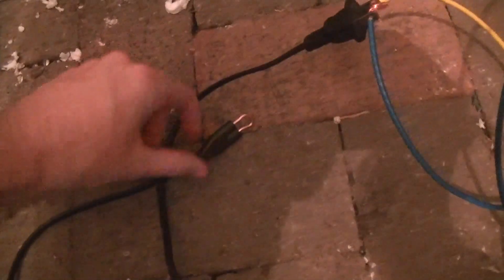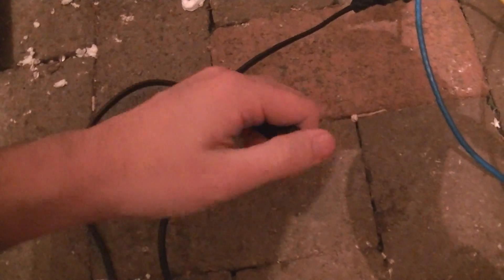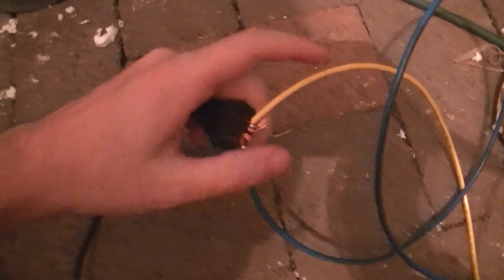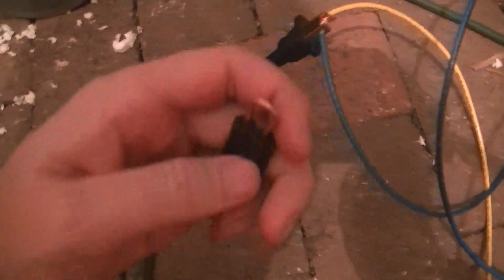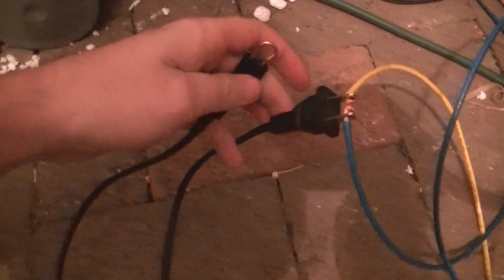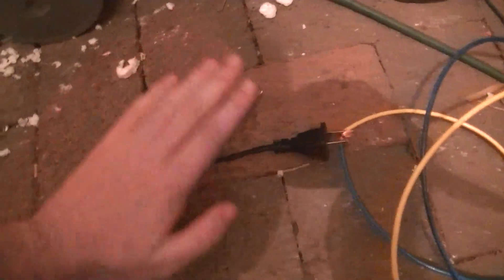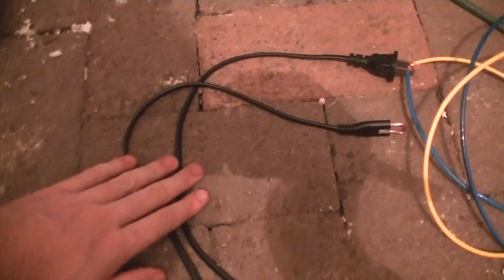This is just a test of the actual current capacity of this piece-of-crap cable that was included with the equally piece-of-crap CR123A cell charger I did a video on recently. We're just going to be passing current from a series of test lamps through this, with this little shorting clip made out of a piece of scrap 12-gauge wire. Don't ever do this with cables that are going to be actually plugged into mains use. This is strictly going to be on the neutral side of a 12-volt DC system for safety purposes. Even then, there's a risk of stuff going poomph because this is a garbage cable, so do not try this at home.